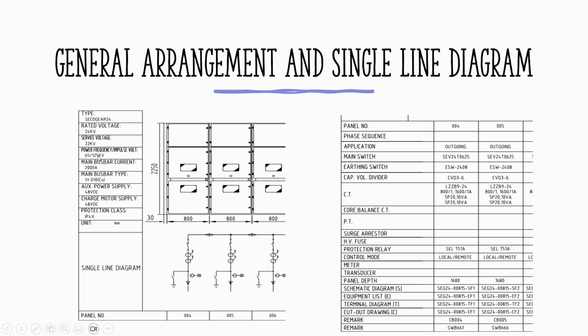The second one, which you see is impulse voltage, is a factory test to test the endurance of this board, the specs in terms of lightning strike. That's your lightning strike, which is a half wave of the voltage. We have one cycle. Where is the drawing, Nick? Anyway, we have a half cycle. When you have a half cycle, it's only 10 milliseconds. One cycle is 20. So one cycle, that one is for your high pot.